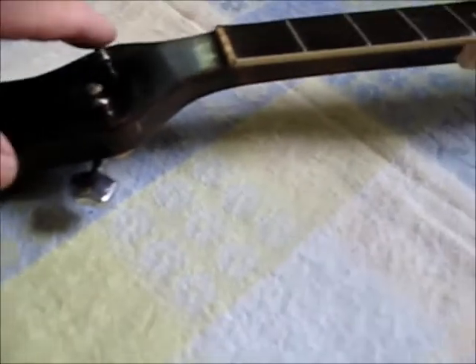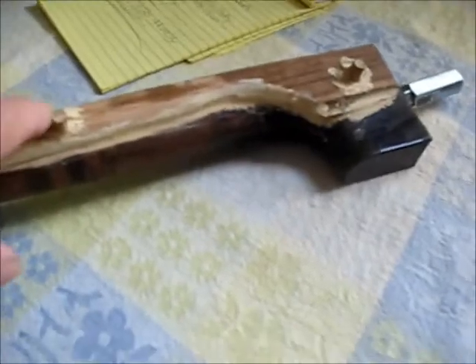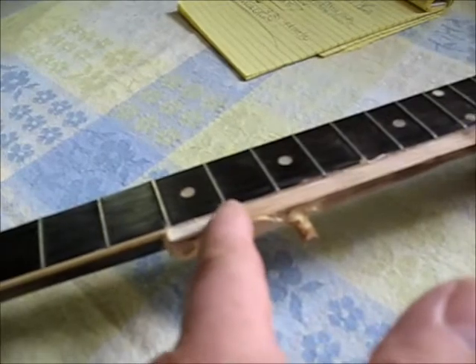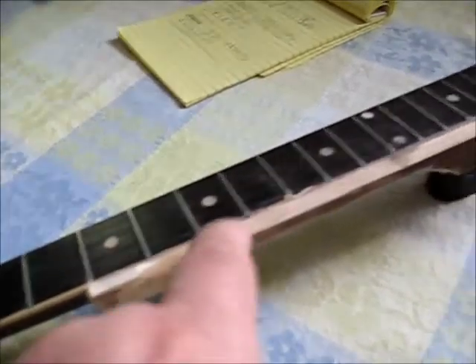One is this banjo neck from Mad Dog Bobby. I got my pegs in place here and I made a banjo shelf and I've roughed it out. I put a little wood putty in around the pegs. I'm going to grind these mounting pegs off. I might grind this spot here down and then I'll put my little fifth string nut right here, clean this all up, and have that ready to mount onto the can.